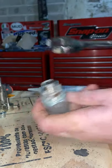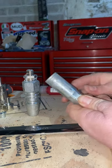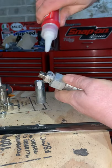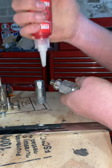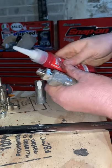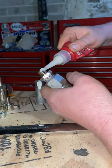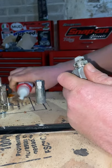Once you've got that tight, take your PCL fitting. You can use other airlines — this just seems to be the UK standard and will take most airlines. I like to use these because you can buy them pretty much anywhere, so if you ever break one you can get your hands on another fairly quickly. Good bit of sealant on there — this stuff really does require some good wrist action to get it out. There is a different dispenser I use that works a bit better.